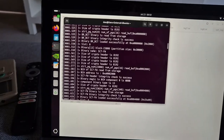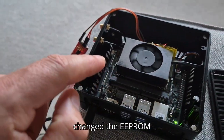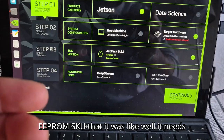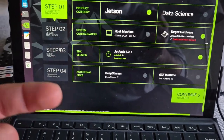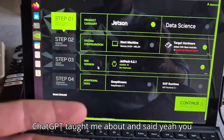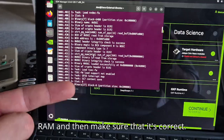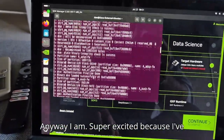That is remarkable because I don't actually know exactly how I did that. It may be that because I changed the EEPROM SKU, the SDK manager saw it as needing a 16 gigabyte DTS or DTSI file — all those files that ChatGPT told me about — and flashed with the 16 gigabyte one. Then the alias checker passed because the alias checker reads the RAM and makes sure it's correct. Anyway, I am super excited — I've tried for months to get this thing working.